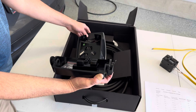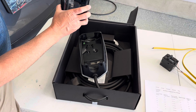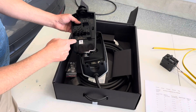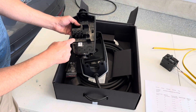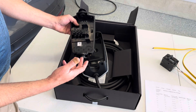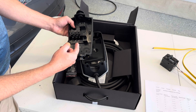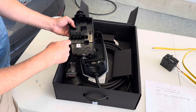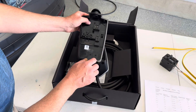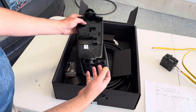The wiring is pretty simple. This mounts on your wall and the power comes in through the top or the bottom. One nice thing with installing this is it doesn't require a neutral wire — it just needs the ground and two hot wires. So you can use a cheaper wire: instead of running 6-3, 8-3, or 10-3 wire, you can use 6-2, 8-2, 10-2, 12-2, or 14-2 wire. It's going to be cheaper wire and very simple — you just mount this to the wall, bring one power wire here, one power wire here, and the ground in, and it's ready to go.